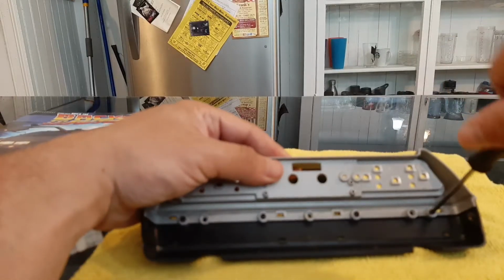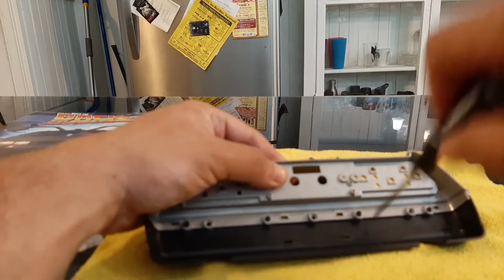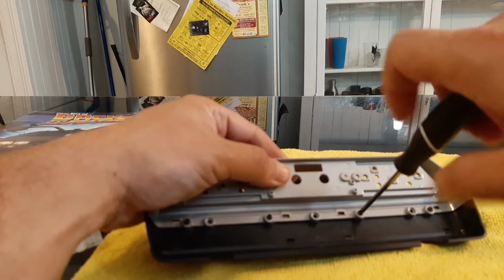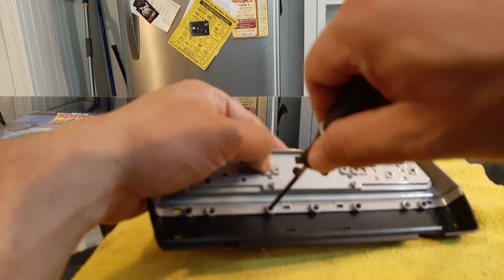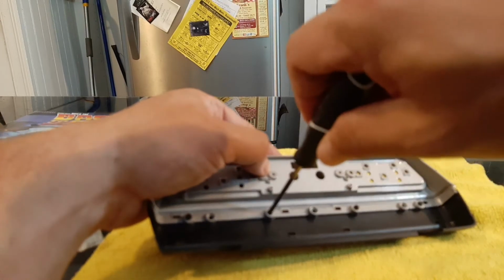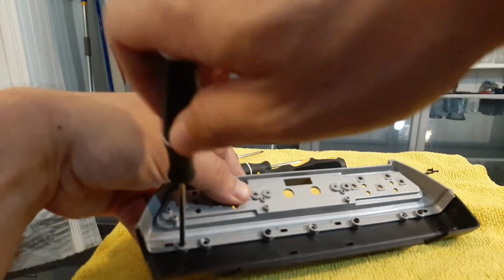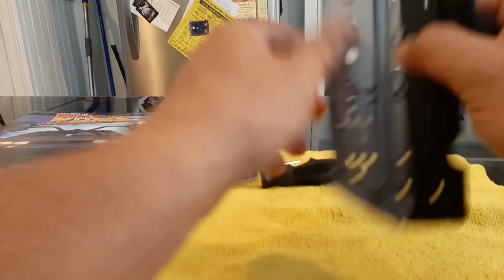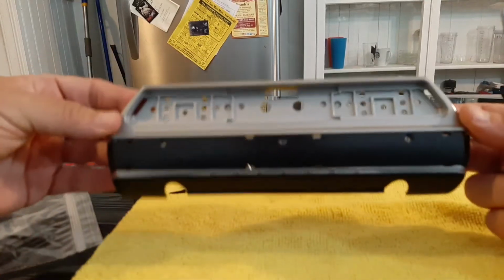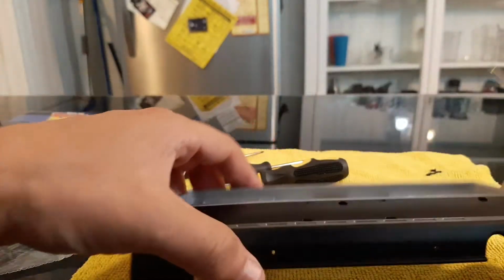Now that's all 4 screws in. Now tighten it down, and once you start feeling resistance, stop, because this is going into plastic. It's going through metal into plastic. You don't want to crack the plastic, and you don't want to round the screw heads. And there's your rear assembly for your DeLorean time machine.